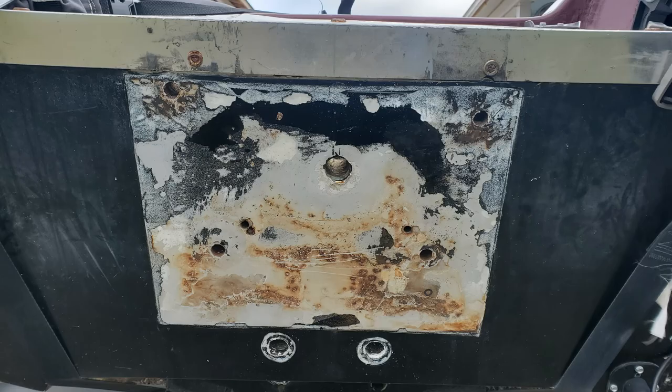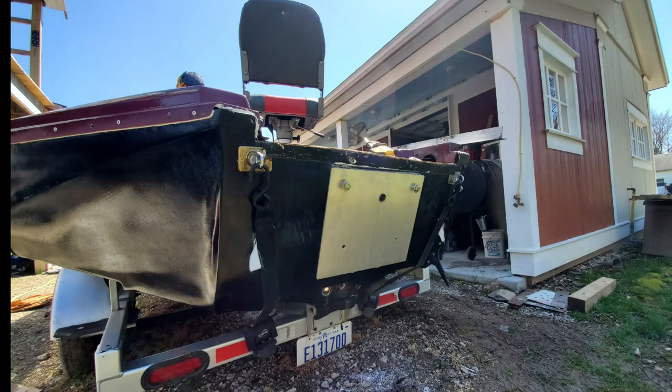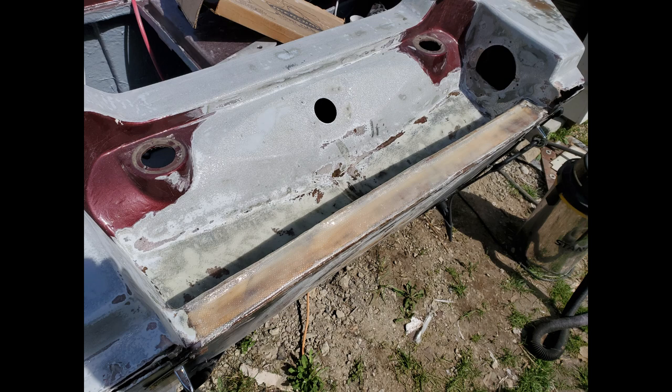I was planning to run a power jack plate, so I had to re-drill the transom for the mounting hardware and fit a new reinforcement plate from aluminum. The original plate was a piece of 1/8-inch steel, which was pretty ridiculous even for freshwater. The transom would need to be stripped down to bare glass and all the previous rigging holes filled and glassed. The drain for the motor well was also in rough shape, so I needed to rework this area so it was watertight and properly reinforced with a biaxial fiberglass mat.